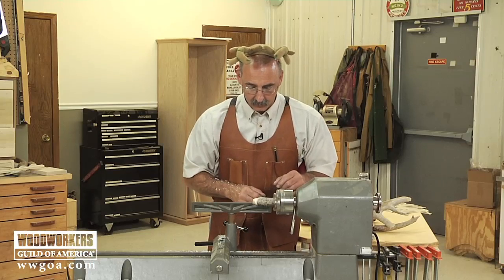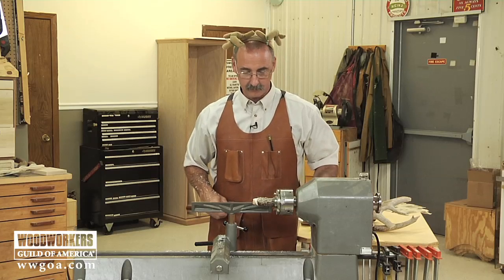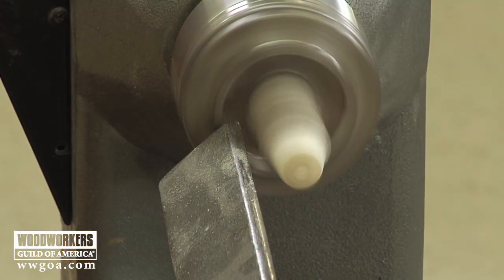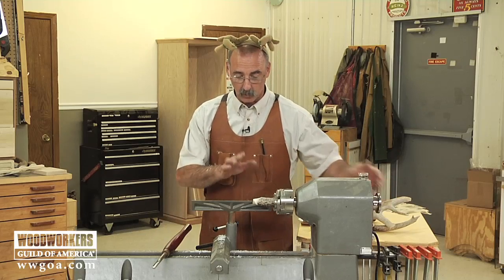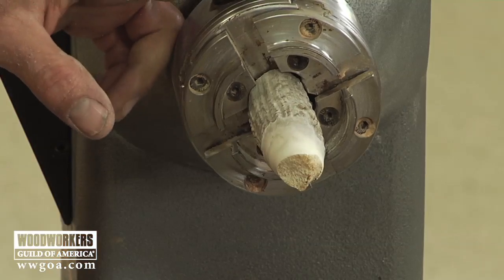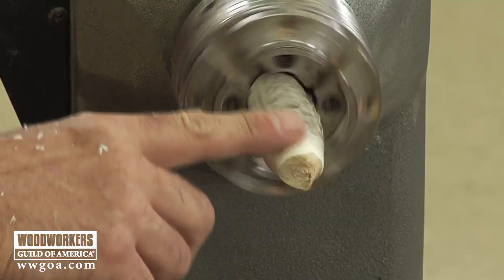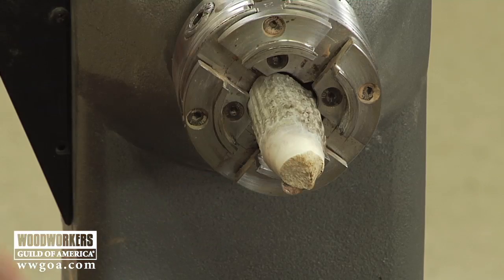I'll do a little bit more cutting, then we'll have a look at what it takes to sand antler and get it real pretty. I'm not sure yet what I'm going to use this particular piece of antler for — I just want to use it as an example to show you what working with antler is like, so I'm going to leave it like that for right now. Now this is already pretty smooth with pretty good cut quality, so I'm going to start my antler sanding at 150 grit and work my way up from there.